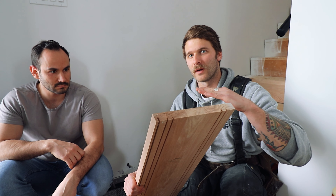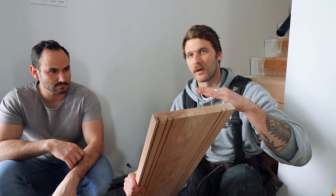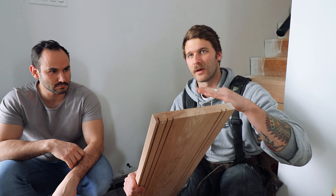Now that I've turned my miter saw to the one degree angle, I'll set the teeth down and run them back where the cut would occur. I can see I've got a little bit of a gap at the back and at the front I'm a lot closer to my line — my saw needs to go this way. So I'll make an adjustment and tighten it down.